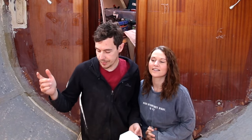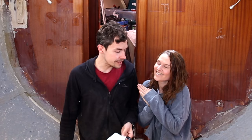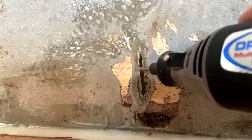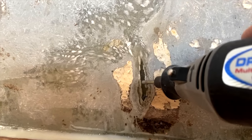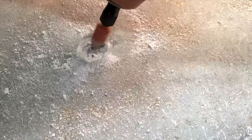Our main aim today is to glass in the floor supports, and hopefully this will be the last time I say 'floor supports.' We've got some epoxy blisters in the hull that we've uncovered, so I'm going to grind those up, put a nice bevel in those, then epoxy and glass those up. Then we'll get the fiberglass rolls out and put these floor supports in once and for all.